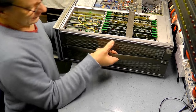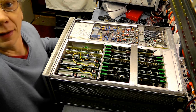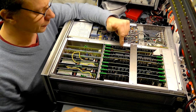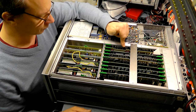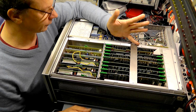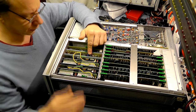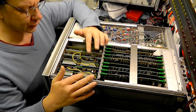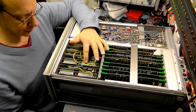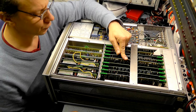That's the unit back together. I think there's some calibration needed. This is the digital source board — there are some adjustments there that probably need checking. I did check some of the timings and they were slightly out. I've got the analogue source board here, the trigger board, and there are the two channels — channel 1 and channel 2. That's channel 1's DAC, channel 1's preamplifiers, channel 2's DAC, channel 2's preamplifiers, and various RAM boards.